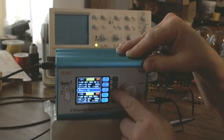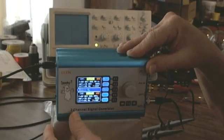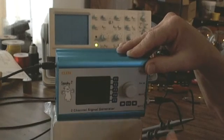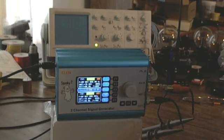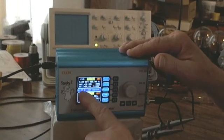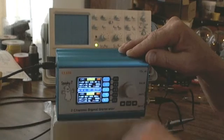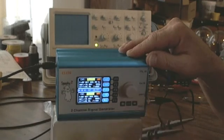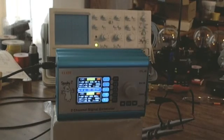I'm going to have the Spooky start up with all those parameters set, but not actually start running the oscillators. I'll save in position zero. Unlike when I first started this video — when I turned the Spooky on and those frequencies started up once it went through initialization — I just saved the parameters but told it: don't start until I tell you by pressing a button. We have the OK button word here, meaning we're at the initialization screen. If we don't know where we're at, press F1 repeatedly to get that OK back.